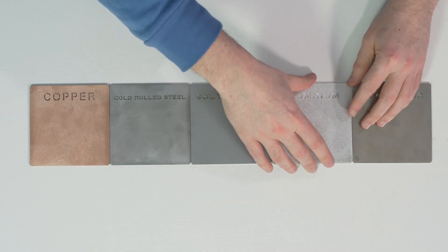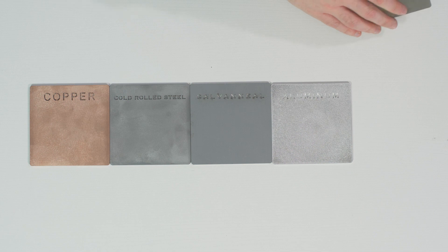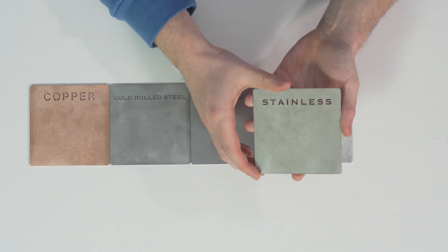A con here is that because of its lighter weight, it's not as durable as the other materials that we stock. You would have to increase the gauge of the metal in order to give it the same kind of strength as something like cold rolled steel. This material is still a good corrosion resistant option, but for max corrosion resistance, stainless steel can't be beat.